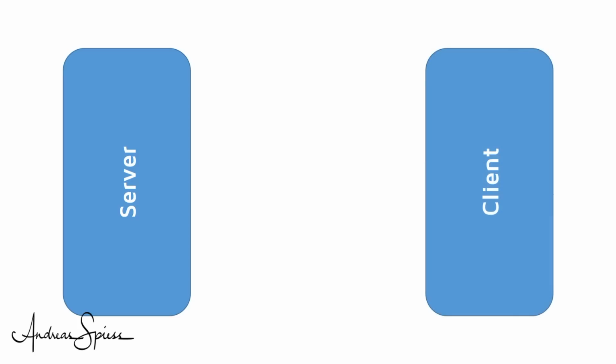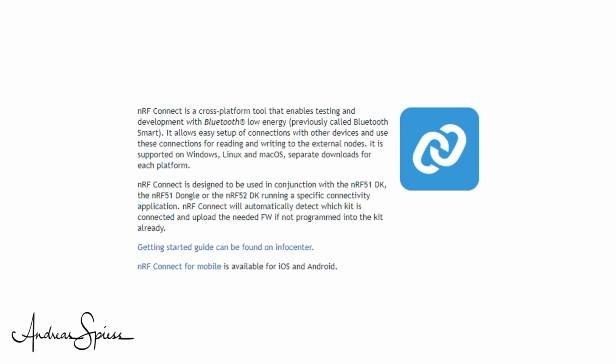For our purposes, we need an app which helps us during our first tests. I tried a few of them. The only one which is useful is the nRF Connect app from Nordic. It is available for Android and iOS. And the best, it is free. So we have our working BLE debugger. Indispensable. I read that you can also use a Linux system to do the same, but I was not successful with my Raspberry. Maybe a more successful viewer can help me here.